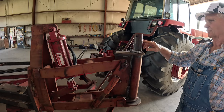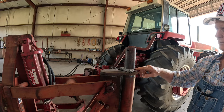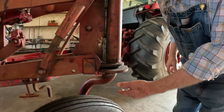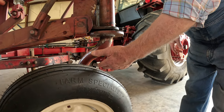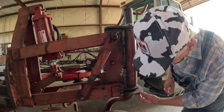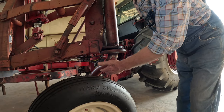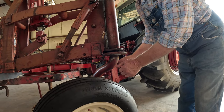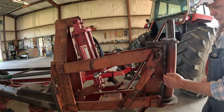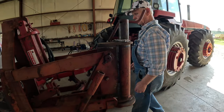But anyway, this tube here had to be lowered too. It was about 4.5 inches or something like that. Lowered this to get the right height. And it still wasn't low enough. Had to get some more. Well, this plus this resting plate right here, we took and cut it off this shaft right here, big 2.5 inch shaft, dropped it down a couple of inches, welded it back. And we had to cut some off of this in here. This whole piece came out, and we dropped it down. But it worked perfect. You'll see in a minute.